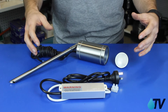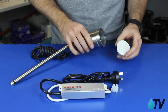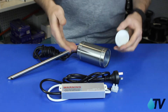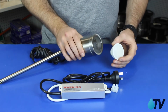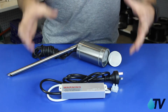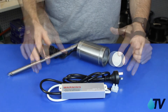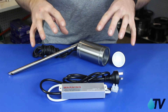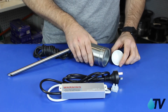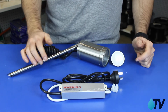If it has to be under 70%, it has to be under 21 watts. What we have here is a 7 watt globe that goes into your Havit Eden light. I'd be limited to having three of these lights on my circuit. Now drivers can go up in wattage to 100 or 150 watts — the same rule applies: 70% of the wattage of the driver. So with this 30 watt LED driver and one 7 watt LED light, I can run three lights of this type through this 30 watt driver.